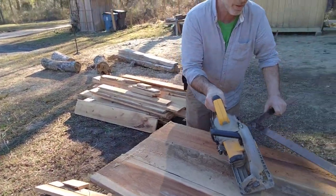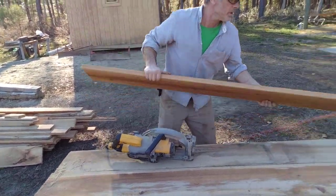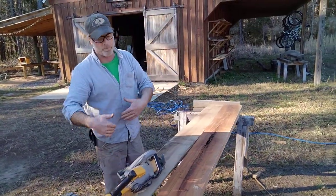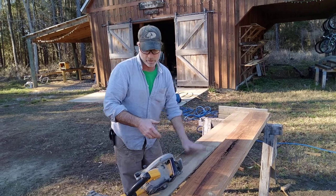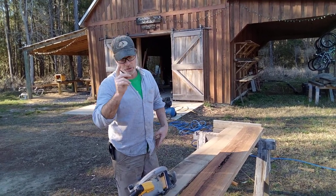This board also acts as a workbench. I'm going to take these two, bring them over, and stack them up. Come back, cut more, stack them up. I stack the whole thing and then go back and nail. So: measure, build your template, cut, stack, nail. Less than two hours for that — and that's working by myself.